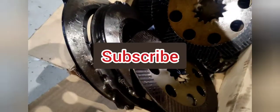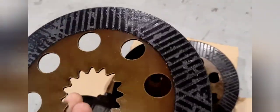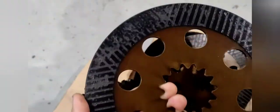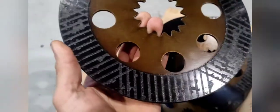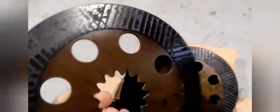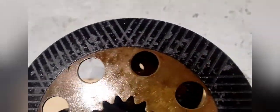These are the disc brakes from the right axle. As you can see they are not that much worn but they are chipped away. I think that's because of the bad oil, because the hydraulic oil got into the differential and they didn't have proper lubrication, so they got chipped.